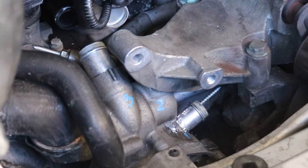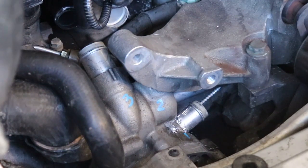using the drill bit M4 by 0.7. And I've got a lot of Vaseline around the outside to catch the chips. And you'll see a screw sticking out. That screw has a piece of foam on the end so that when I'm done, I can pull it out and the small amount of chips that are inside will be pulled out. Then we will pin this one, and I will put some of my paste form of adhesive around as a flange. So here we go.